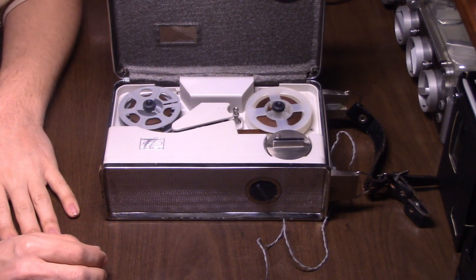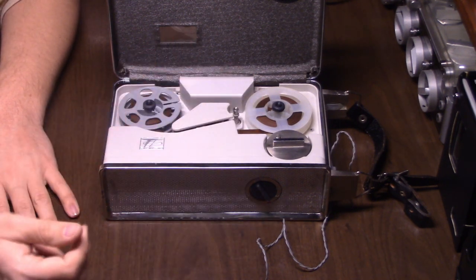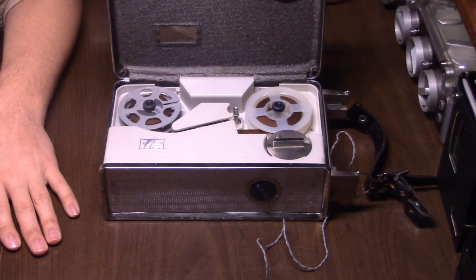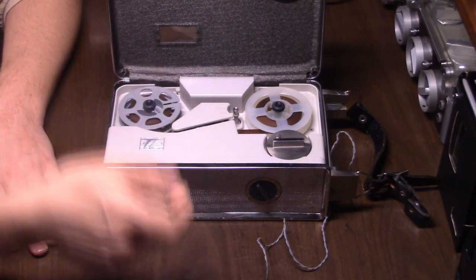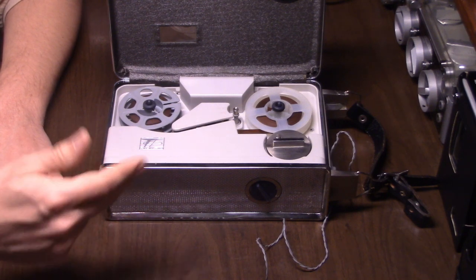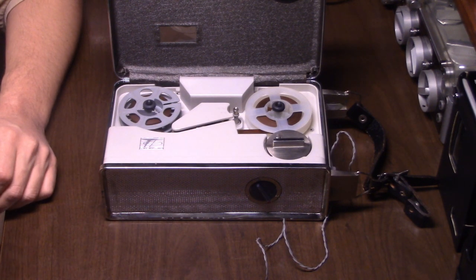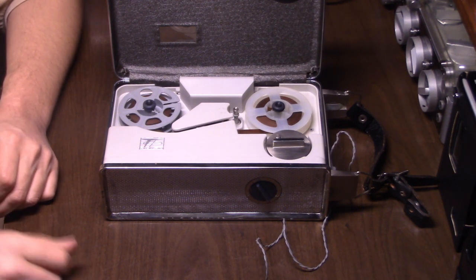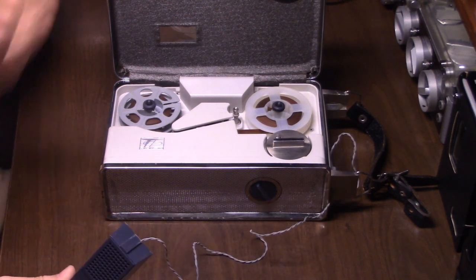The amplifier, of course, was extremely weak — pretty much no sound coming through the amplifier off of the tape. Even though a signal injector at the head would produce sound, when you tried playing a recording made on tape it was so weak you could most faintly hear sound. It was leaky electrolytics. Replace the electrolytics — problem solved.